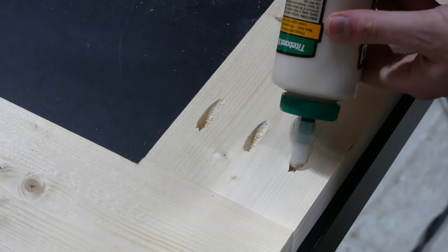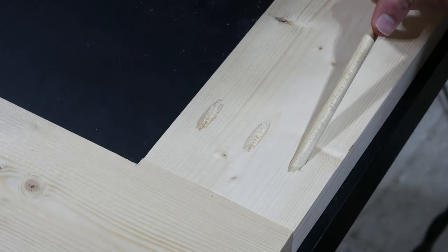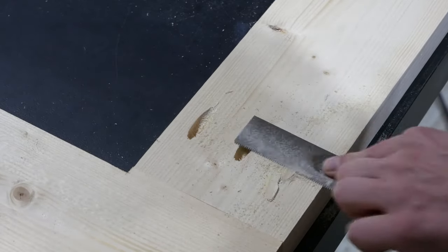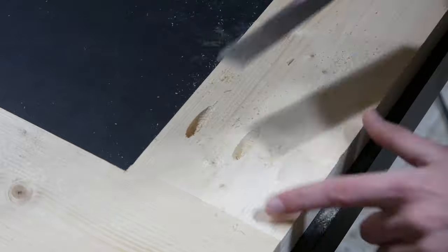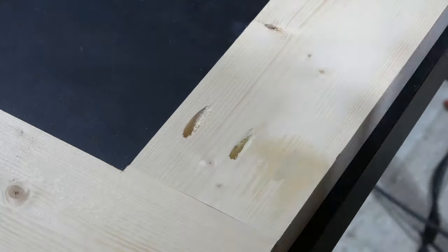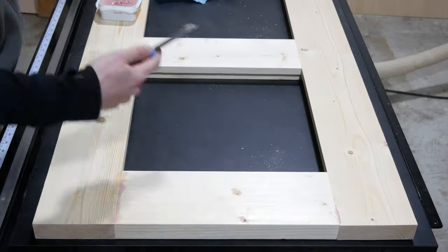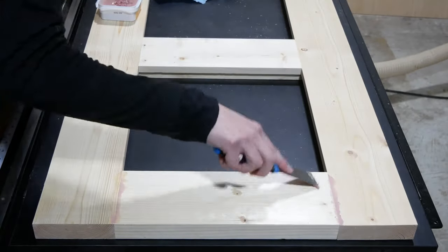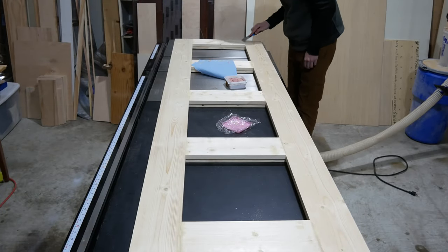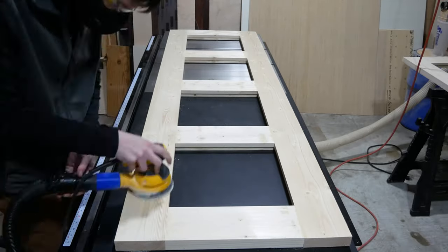If you're going to make a door that looks good on both sides and not just the front, you need to fill the pocket holes. To plug the holes I put some wood glue in the hole then inserted a 3/8 inch wooden dowel. Next I cut off the dowel with a flush cut saw and then spread some wood filler on top, and when it was dry I sanded it smooth. The doors are fully built at this point and need to be prepped for paint. Alternatively you could choose to stain them instead of paint and that would look great too. I started prepping for paint by applying a layer of wood filler to all the knots and seams between the rails and stiles on the front and sides of the door. When that was dry I sanded it all smooth with my orbital sander.